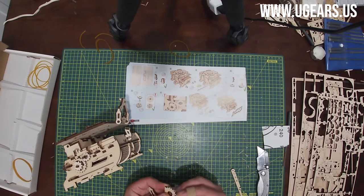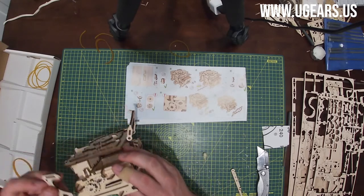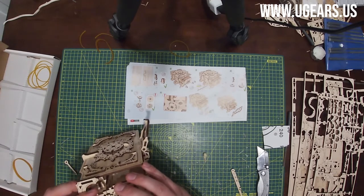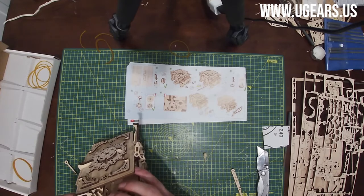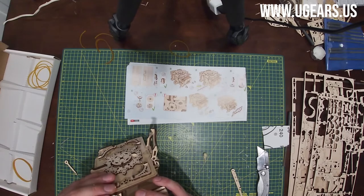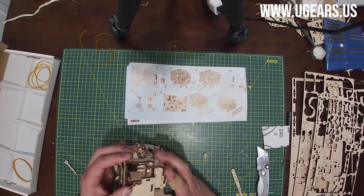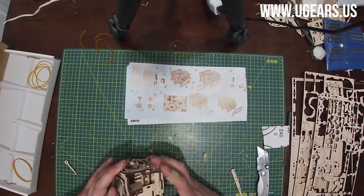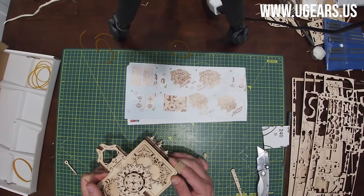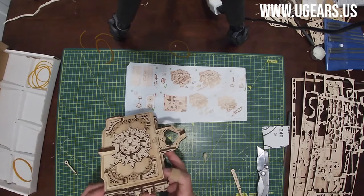And then next step, we need part number 56, the one that we already had out, and the mark, so we need to match the gears on there. And the mark on here should match the mark on gear L2. We put it over, let's see, just like that, over the little cross, onto the cross, and then marks match, and then we insert the tab into the cover. As far as it can go, make sure everything matches. Nice.